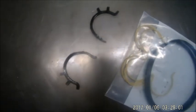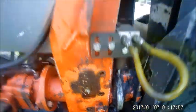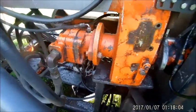So we put them new in there, put it back together, and we got 2,000 pounds easily built on our relief valve. Got all the hydraulics where it needs to be. Got 2,000 pounds back here at the conveyor. Got to get a couple lines. Got to get a new shutoff valve here for the carriage travel. I want to have that fixed, so you don't bend the bar. Can't move in when the saw bar's down.